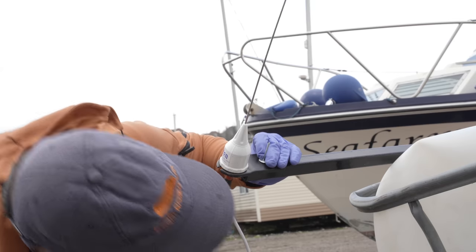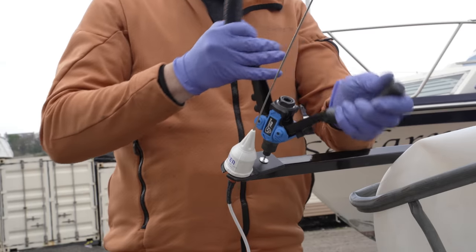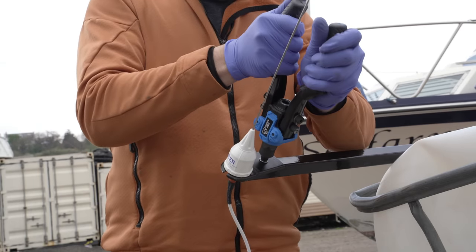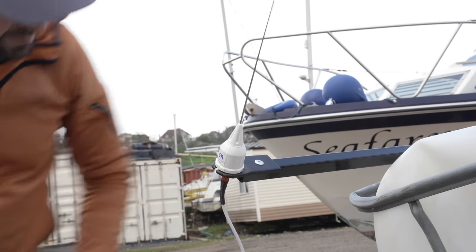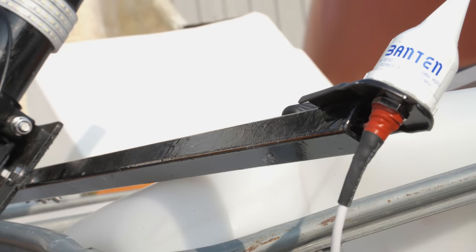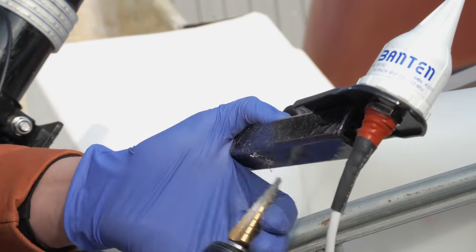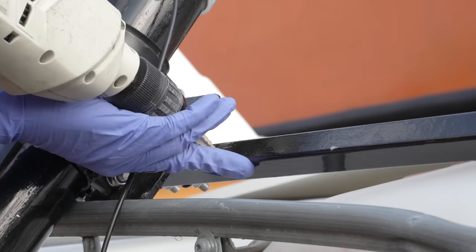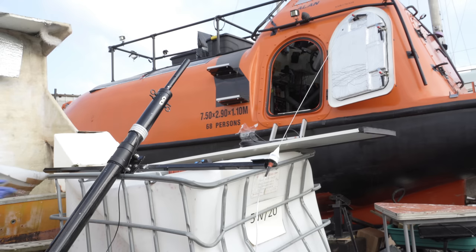Okay, back to the mast, and I'm using one of these peel rivets. Quick, easy, doesn't crush the box, and can be easily drilled out in the distant future should the mount need to come off. I don't want cables flapping around all over the place, or vulnerable to snagging, so it'll head up into the box section cavity. I decided to step drill my way into that same cavity, to a size that fits one of my silicon friction fit grommets. Of course, there's dust in there, and I took care not to breathe in at the wrong moment before the grand puff.